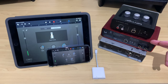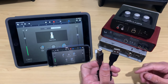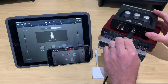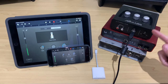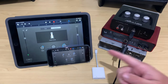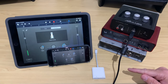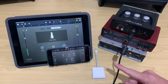Most of your smaller two-channel audio interfaces will come with a USB-A to B cable. All of these have the USB-B port, which is what we plug in to both power up the interface and also to connect and send data from the interface to and from our device. The problem is that our iPad and our iPhone doesn't provide enough power to actually power up these devices, so there are other things we need.